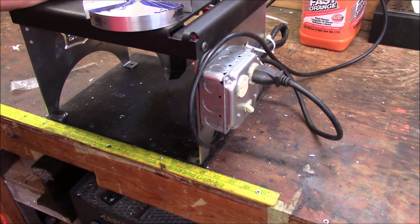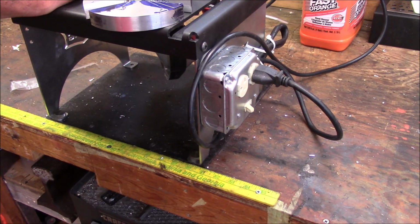So here's what we're going to do. We could either put this thing back in the mill and try to mill it, or what I'm going to do is the quick and dirty method. I'm going to scribe it. I'm going to take the Portaband and I'm just going to saw these off the lines and see if I can get it into the chuck, in between the chuck jaws. And then we'll proceed from there.